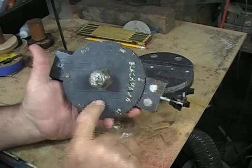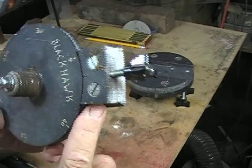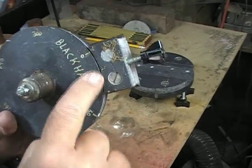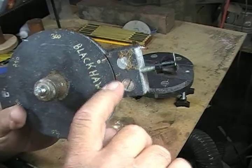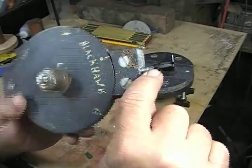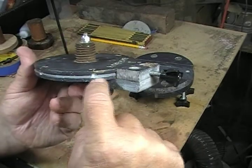Now, that puts the ring on here. You're indexing. On one end, you cut this block — see how that block is cut? I've got about a sixteenth or an eighth of an inch gap; that can be more, it can be less. And one index mark. That index mark — don't worry about where it's at; I'll tell you how that works. This is drilled and tapped to go straight through and hit the center.